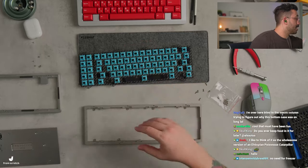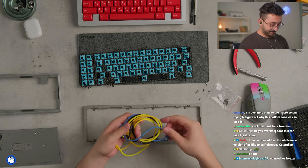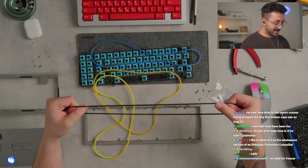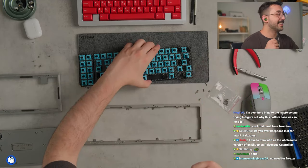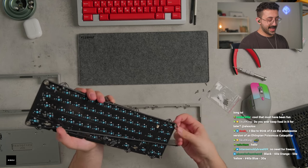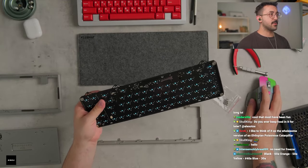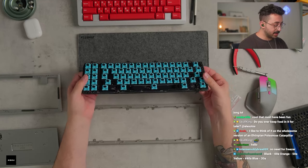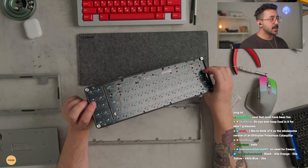So for o-ring mount: install the four custom standoffs — did that. Place one side of the assembly as shown in the diagram and install the o-ring first. I don't know all the durometers for this so I'm just going to play a guessing game — which one's the firmest? I think the black one. Attach the o-ring between the PCB and standoffs. So unlike typical o-ring mounts, this would go on the standoffs. If you wanted to use regular screw-in stabs, this would be totally fine.